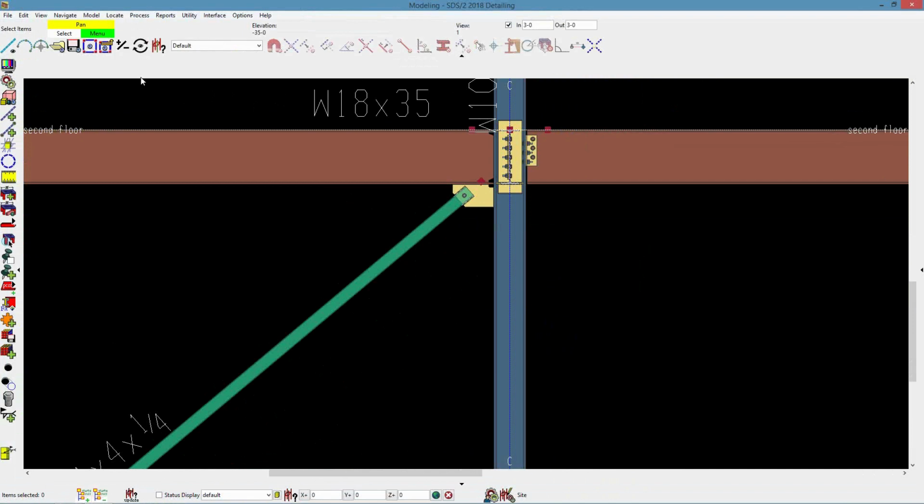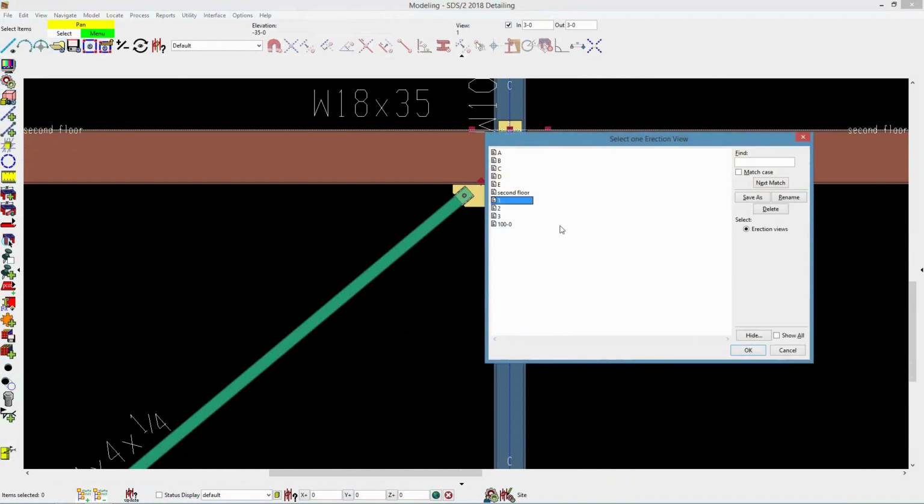Next we have Seismic Design. When it is used for 2-point shared gusset connections, there's an additional option that can be set to use the AISC Seismic First Edition 2-point shared gusset. This can be set at each end or in the design criteria.